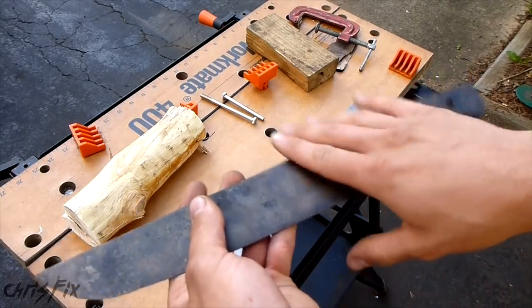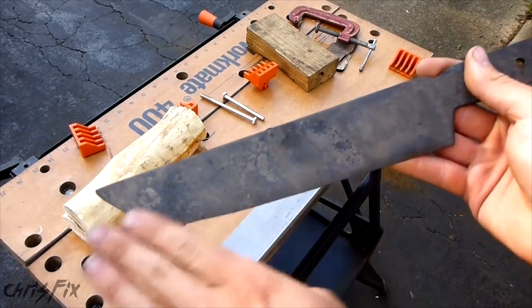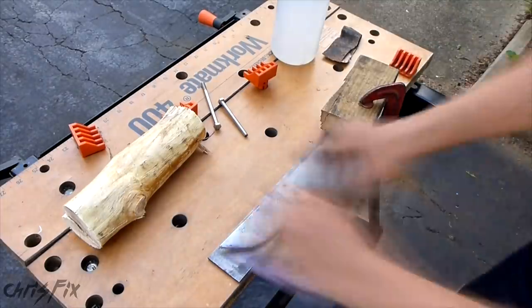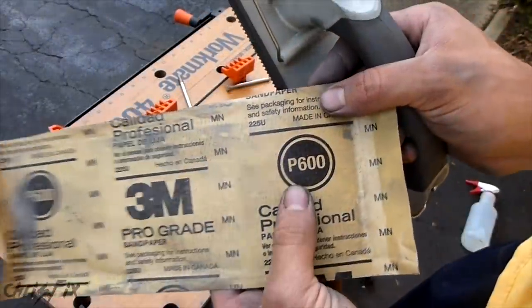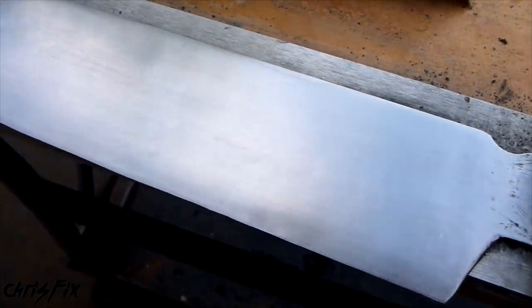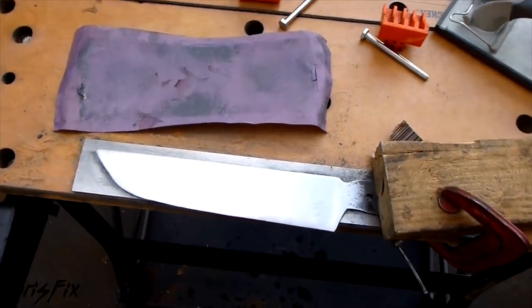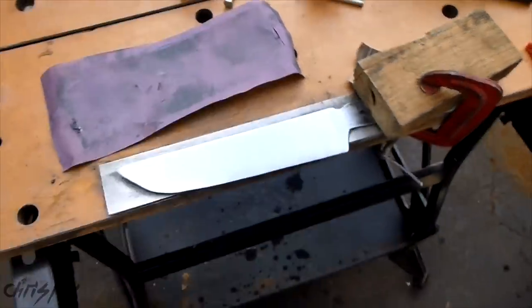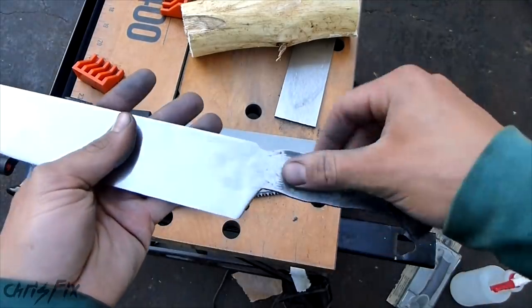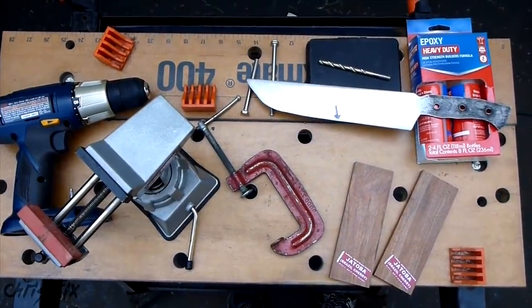In the daylight you can see the scaling on this isn't bad since we got the finish nice and smooth and kept it in an area with very little oxygen deep inside the fire — that's going to make cleaning this up a lot easier. The thing to focus on now is we don't want to sand this so much that it heats up. We're going to go through the same sanding steps as before except it's easier because it's just removing some scale — starting with 400, then 600 grit. I finished off with a wet sand and it came out really nice: smooth, no dimples. I'm done sanding both sides and used a little degreaser to clean off any oil. Now we're going to work on getting the handle on the knife.